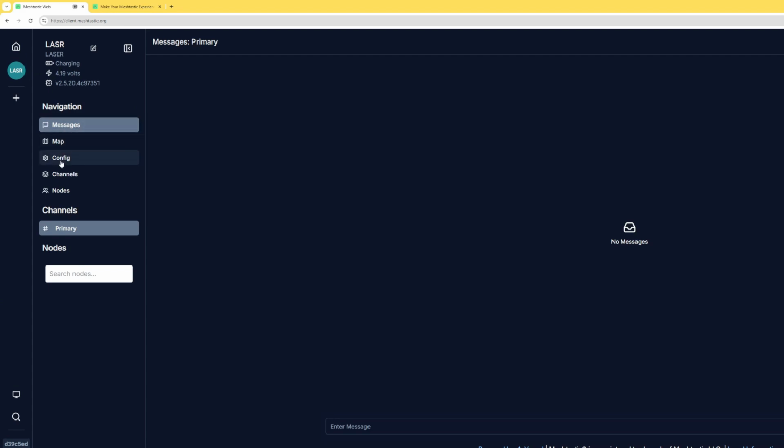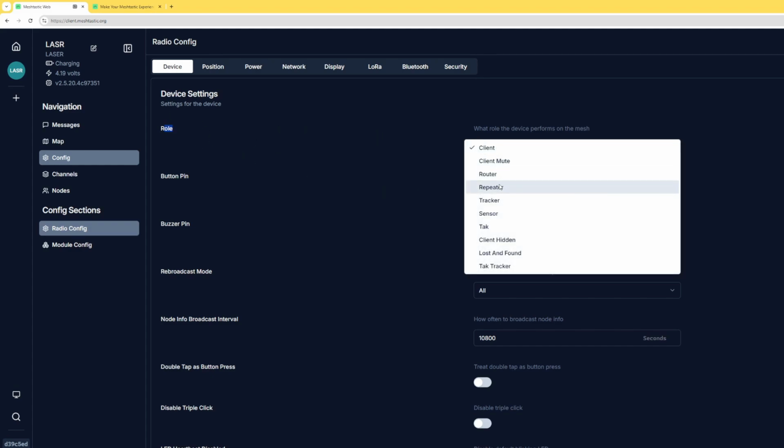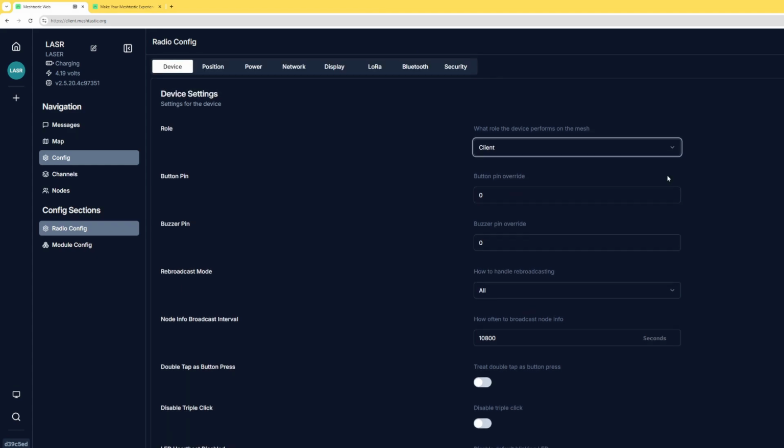Next up, we're going to go over to the Config tab, and when we click on Config, there's just a few things we need to do. Number one, it's important for us to go to Role right here, and under Role, we're going to want to select the proper role for this Meshtastic node. There's some really cool stuff in here, like having lost and found and a tracker. However, if this is your first node, you're probably just going to want to select Client, and we're going to leave it at that for right now. I will link below a tutorial or a guide that shows all about the different role types, and one or the other might be better for you.